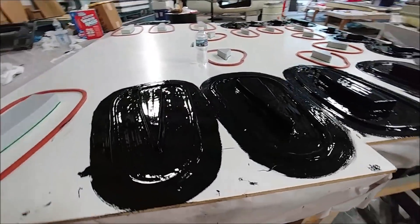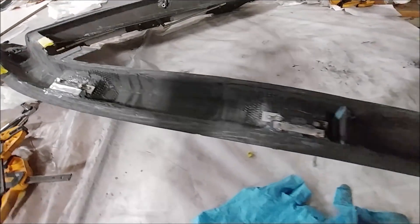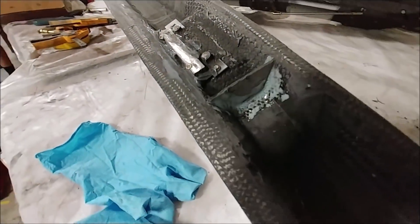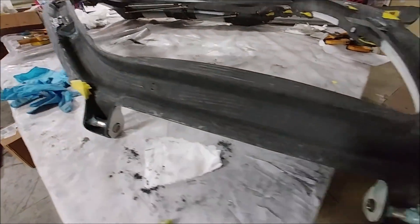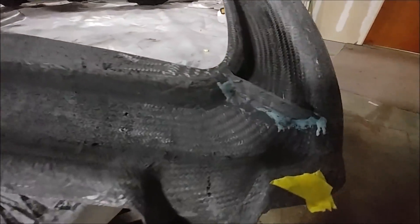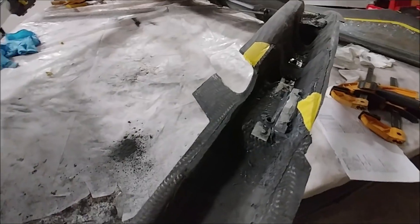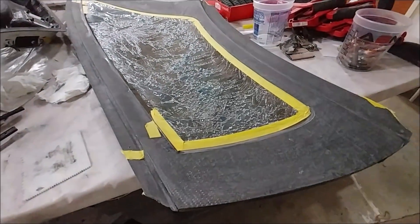Back on the doors — now that the window is bonded into the frame, it's time to bond that frame into the actual door frame. One of the problems I had when I designed these doors was I didn't set up a really good way of indexing the window and window frame into the door frame. Now that I've done the first one I've thought of some better ways of doing this, so on the other side I'll do a better job. I've been using yellow tape to align where the window sits and hope for the best.